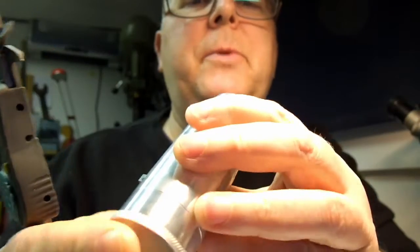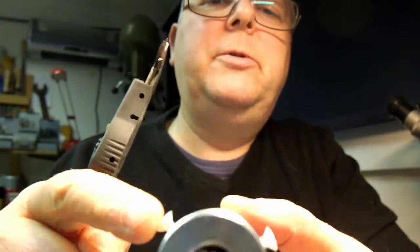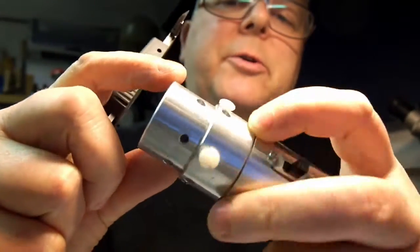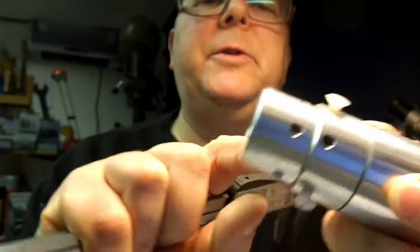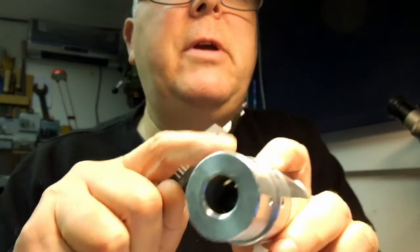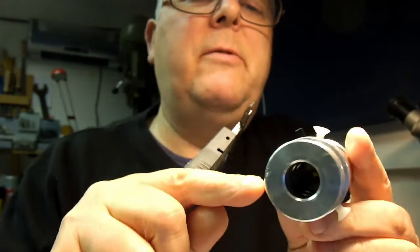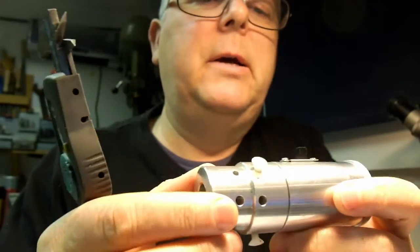and it's held inside by six plastic or nylon screws. Three of them have been chopped off and are threaded through as set screws or grub screws, which are holding the front of the unit. I'm going to do a little drawing for you in a moment. And then the three rear ones, which are the ones you use to collimate the collimator, which is something you have to do, I've left those with slots in them so that I can get a screwdriver in, or you can just turn them with your finger.